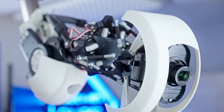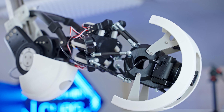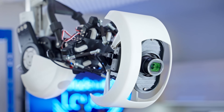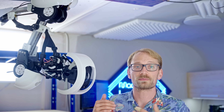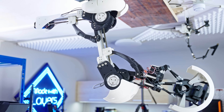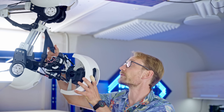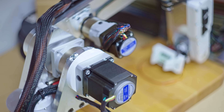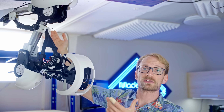Running on their own, they look pretty great, but with the amount of friction they have internally and with a camera hanging off the front, they will often fall into a sort of stick-slip rhythm when you want them to move just a little more slowly. There's a lot of stuff that I now know how to solve better, but honestly I'm still really proud of what I built here. The base concept of using these scissor-lift axes works really well, and it absolutely does make for a much more rigid kinematic setup than using those super high-geared stepper motors right at the joints where they see the full leverage and have insane torque requirements.